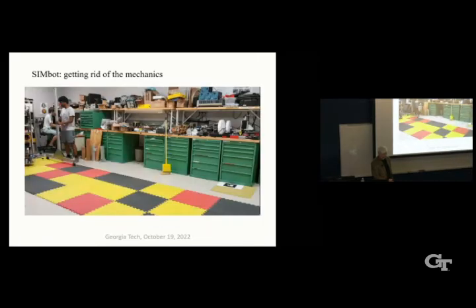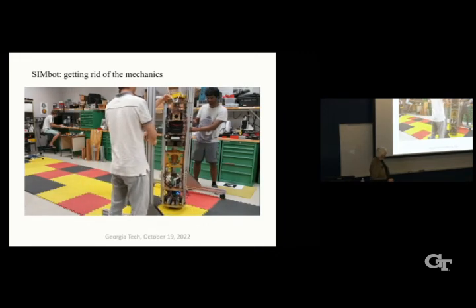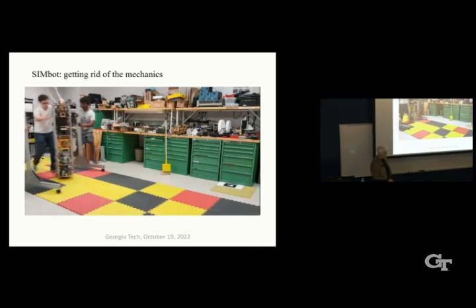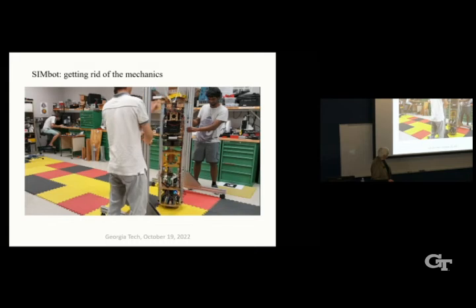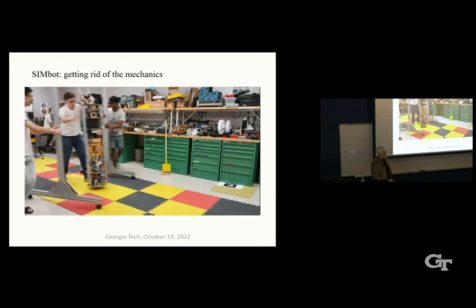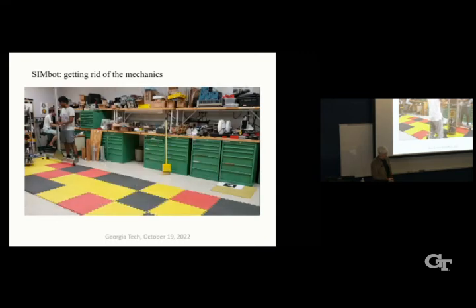So meanwhile, here is a video showing how fast it can go. It can go about 2 meters per second, where a ballbot actually can go 2.2 meters per second, which is pretty impressive when it's coming toward you. I think the limitation on speed here is the optical mice can't track any faster than that on the ball. Even the laser gaming mice.